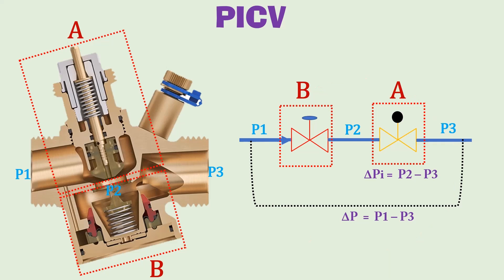Water flow through a control valve is represented by the flow formula. From this formula it is clear that if the flow coefficient CV is constant, then flow would change with changes in delta P. So the goal is to maintain constant delta P across the control valve in order to maintain constant flow for a specific valve opening position, which is controlled by the actuator. For this task the balancing valve comes into action, and the spring moves upward or downward with variations in pressure across the PICV to maintain constant delta P across the control valve section inside the PICV, achieving the desired constant flow.